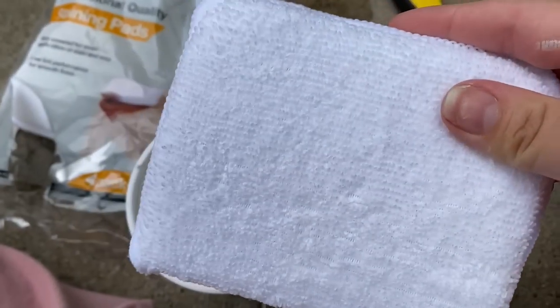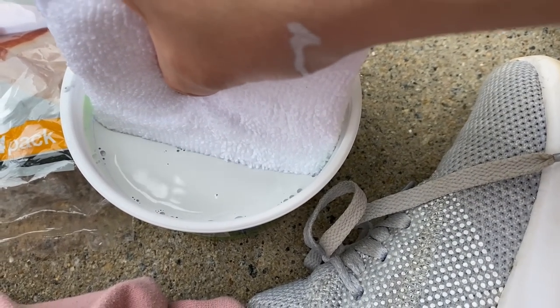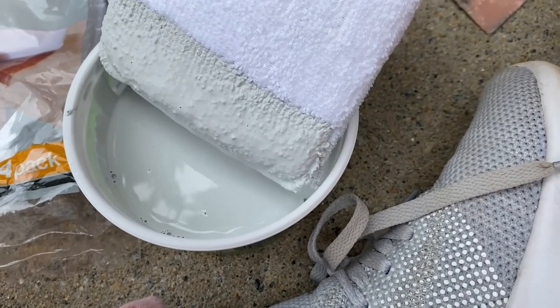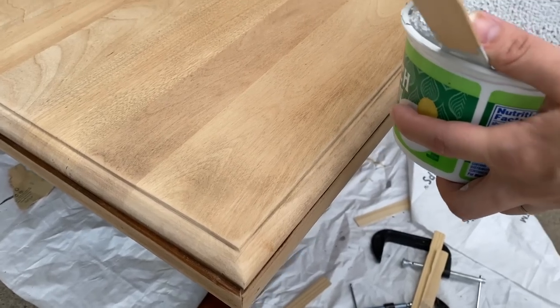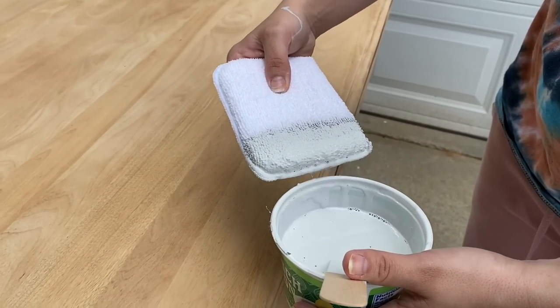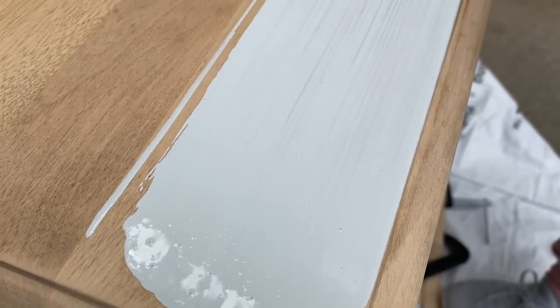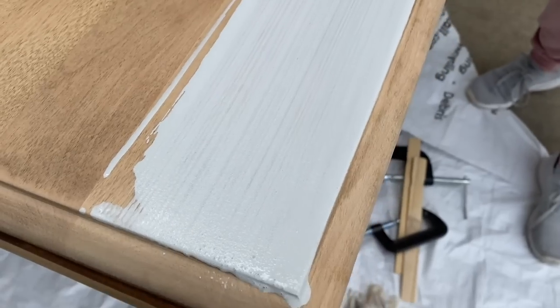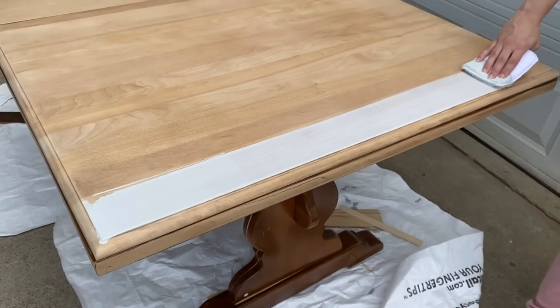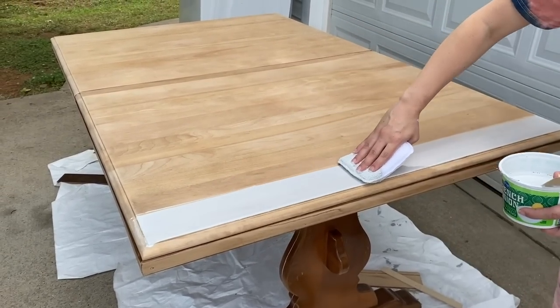And then I'm gonna wipe it on there with this staining pad, but you could use paper towels. I've experimented with a couple different things, and I'm no master at whitewashing and all that stuff. I'm still figuring it out. It would be awesome to have this be a two-person job. One person wiping it on and continuing to keep a wet edge, while the other person goes behind you with the paper towel and wipes it away, or a towel or whatever.